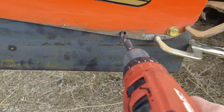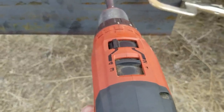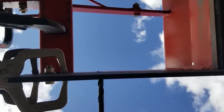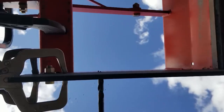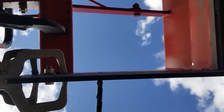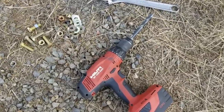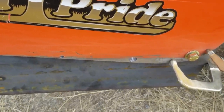You see that getting hung up? But what I wanted to show you — I'll have to do it with two hands. At the end of the hole, if you just ease up on the torque, ease up on the throttle, ease up on the feed pressure, then you never have to worry about shattering your drill bit.